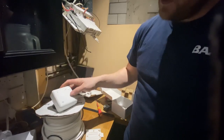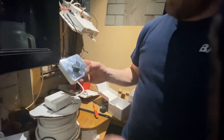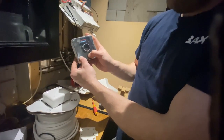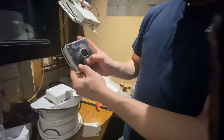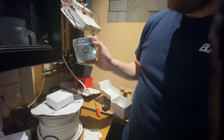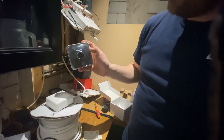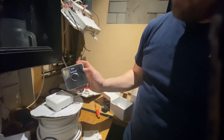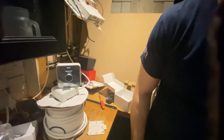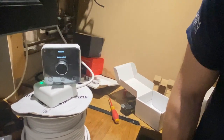There we go — it started flashing. That's the standalone version of Hive without the hub. Now we put the battery in the Hive and hold those two buttons for 10 seconds — it'll come up with a factory reset. That's just going to do a quick reset. Once it's done its reset it's just going to start searching. It's saying 'Welcome' — I'll click English and it's searching now. I'll leave that for a few seconds while it searches for the receiver directly below it, and it's going to say 'Pairing ready' — there it goes, pairing now.